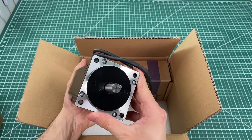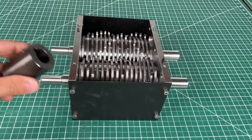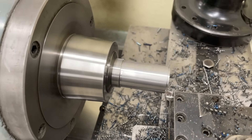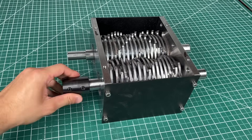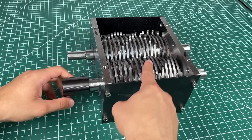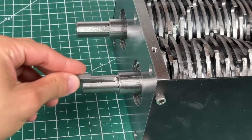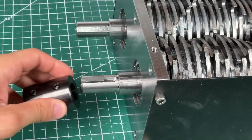We decided to start with motors, so our next step is installing the two couplers onto the shaft. We used a lathe to turn down our shafts to the proper diameter and the couplers slid on perfectly. Unfortunately, they can't grip the shaft tight enough on their own, so we also machined keyways to help transfer torque from the motor to the shaft.